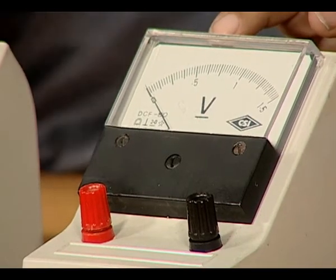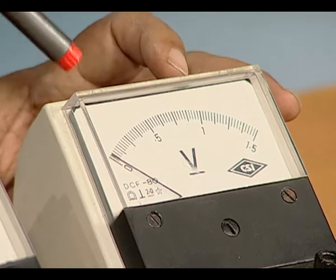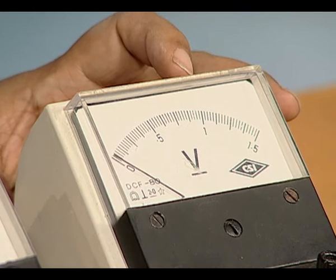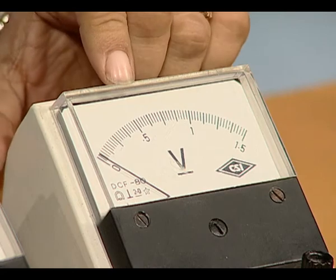You may also need a voltmeter. The purpose of a voltmeter is to find the potential difference between any two points in a circuit. The voltmeter also requires a small portion of current to pass through it; otherwise it will just not work on principle. So a small current is made to pass through the voltmeter and it is always placed in parallel to the points where the potential difference is to be measured. Zero is at one end and the extreme end of the scale gives you the range. The graduations suggest how many volts is the potential difference, and you use the least count and the divisions travelled by the pointer to find the reading.